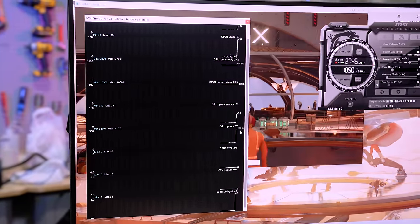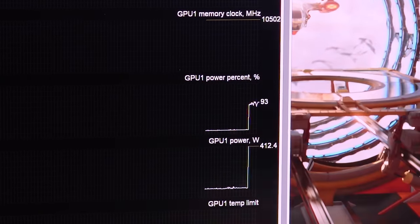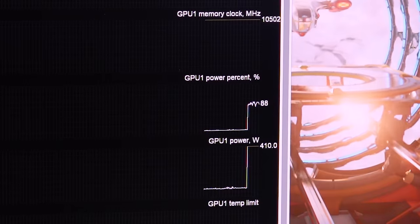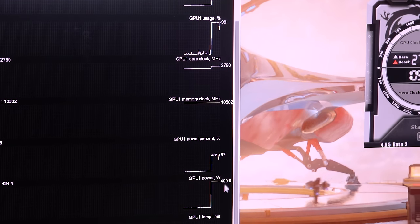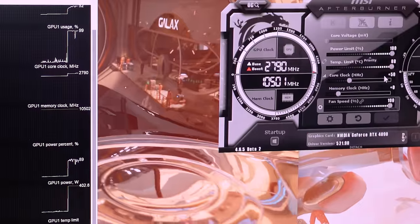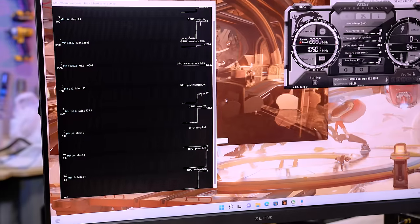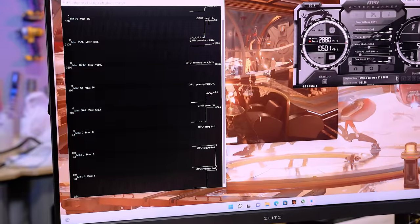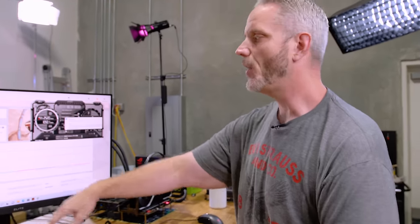Even by having that pin not occupied and overclocking this card to where it crashes on the voltage allowed to it — no issues there. Now I need to shut down the system and switch the pins. It looks like we're getting a no boot on the 4090 with the 300 watt spec. Windows is booted right now — this is temperature showing for the OS while it's loading everything in the background. But the card — we noticed the fans didn't spin. With the 450 spec, you initially hit it with voltage, the fans would spin up and then slow down. With the 300 spec, if I hit power, you're not going to notice anything happen. Even the LEDs aren't coming on.